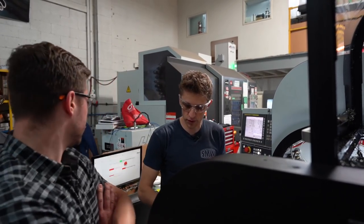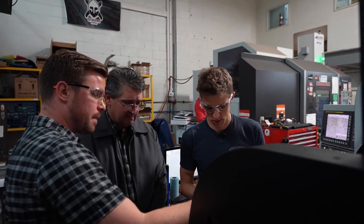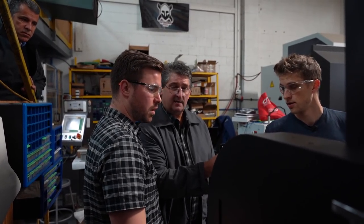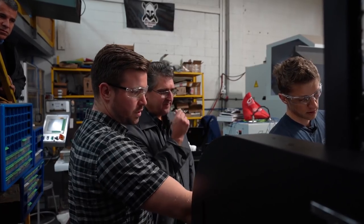And then so you could potentially have all stationary lathe tools in there, instead of any live tools whatsoever. Right. Well, there's 30 positions and you have 12 driven tools, right? Okay. And you got 10,000 RPM on those. Right. All comes with those, yep.